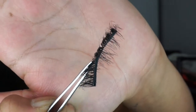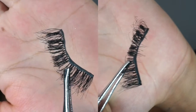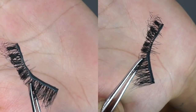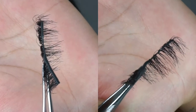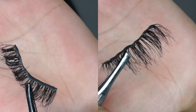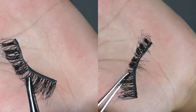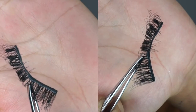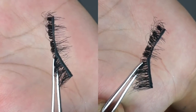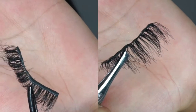This is what it looks like when it should be getting tacky and ready to apply. I know it's a little harder to tell when you're a beginner, so I just put these side by side so you know when the glue is tacky and ready to apply. On the left is what it looks like when I first applied the glue — it's a lighter gray and more wet looking. On the right is what it looks like after 10 to 15 seconds — it's a little darker and looks more tacky.